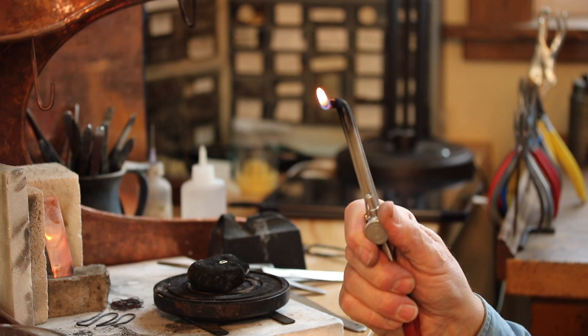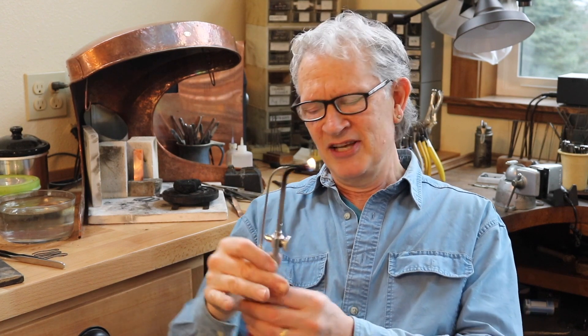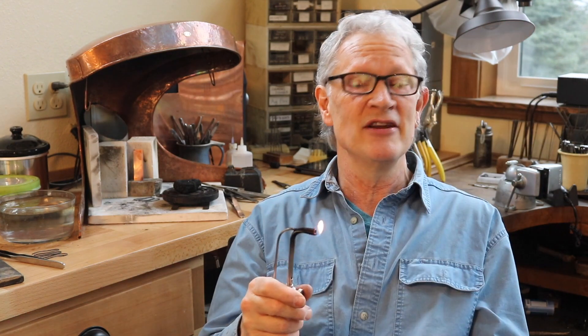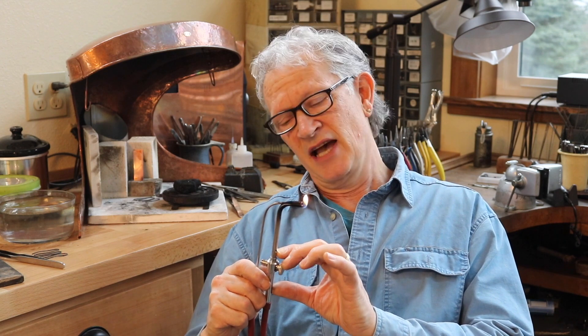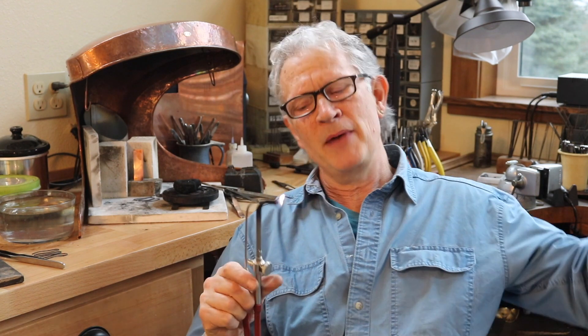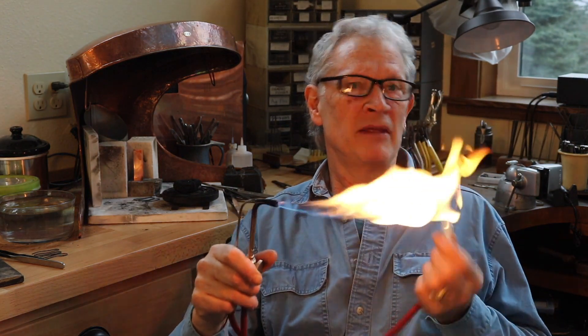This is my all-time favorite torch and if you feel adventurous I recommend giving it a try. The blowpipe also has a nice pilot light that always stays lit so you're not always having to relight it. I'm running propane through this torch, but it was actually designed for natural gas. If you run natural gas through it you get a much smaller, much less reducing flame. The reason I use it with propane is because the larger orifice — designed for natural gas — allows more propane through, giving me the biggest, fattest, most reducing flame I can get.